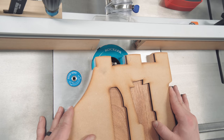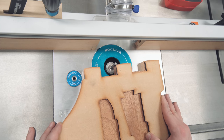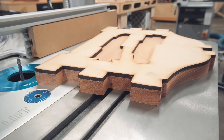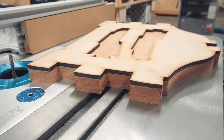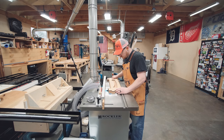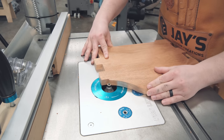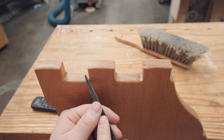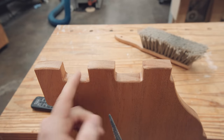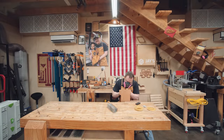This means you'll be cutting uphill in some cases and might get some tear out. For the side pieces I used only the small bit just to see how much tear out would happen. It wasn't a tremendous amount but there was some in places. Then everything gets a round over — I'm using a one-eighth-inch radius round over on all edges except where the handle will go. This small radius allows the joinery to seat flush without using a chisel to square the inside corners. Due to the radius of the bearing, the round over bit can't quite make it into the inside corners, so some light touch-up with a rasp and sandpaper is needed. The alternate approach is to skip the round over bit on the inside of the joints and just chisel a tiny bit of waste on the inside corners to make everything square.